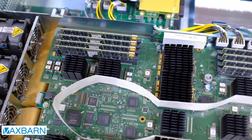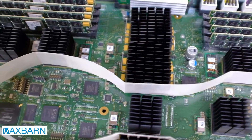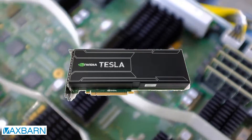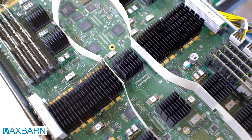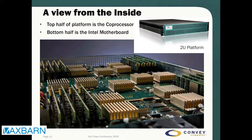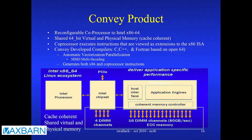To figure out why all this configurable logic, let's take a look at the architecture of this machine. This is a coprocessor system used for high performance computing. Most coprocessors for HPC, like NVIDIA's Tesla, use graphics processors to accelerate computations. But this coprocessor uses FPGAs. To better understand the architecture, we'll look at the HC1 and HC1EX first. The HC1 used a board similar to this one in a 2U chassis similar to this one, but in the HC1 the bottom half of the chassis contained a two-socket Intel Xeon motherboard. Only one of those sockets had a Xeon processor in it; the other socket connected to the coprocessor through a mezzanine card. The coprocessor implemented the front-side bus architecture of the Xeon processor to maintain cache coherency between the Xeon processor and the custom coprocessor.